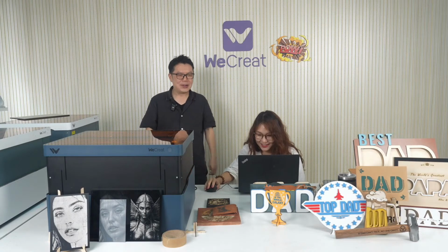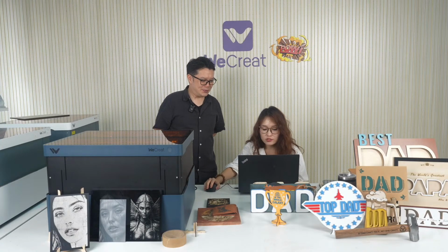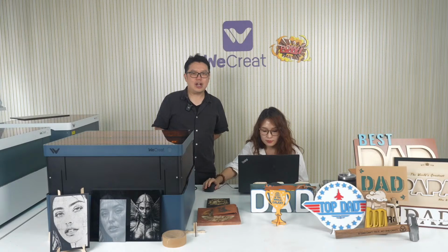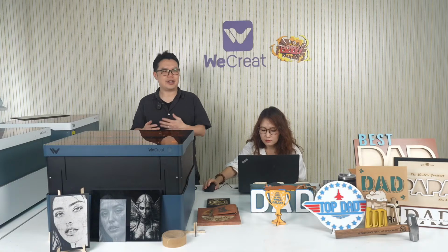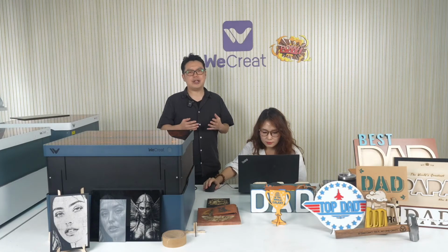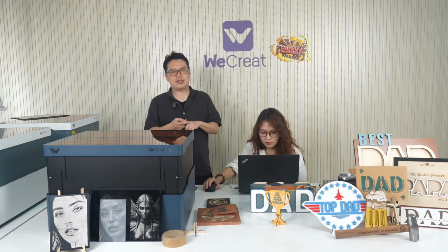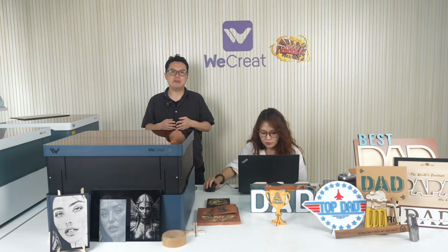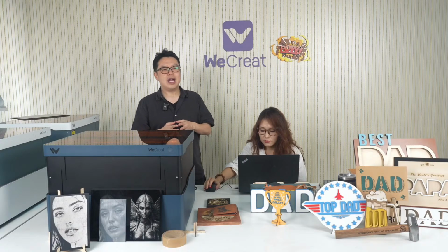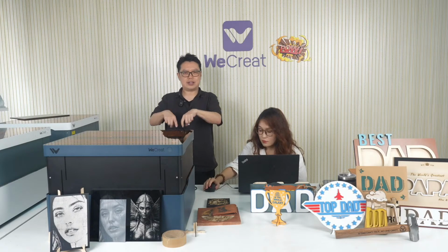Okay, next question from Stacy. I read about the camera calibration. How often do I need to do that? Not really often. It's not a day-to-day maintenance kind of thing. Camera calibration is really used to troubleshoot two problems. The first is when the engraving or cutting is off by 2 millimeters or more. The second is when the app isn't correctly showing what the camera is capturing.